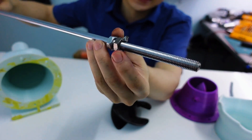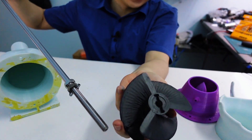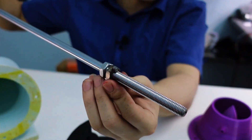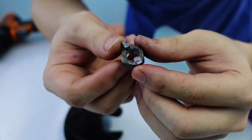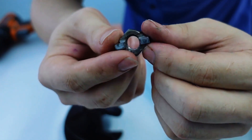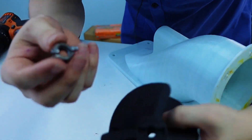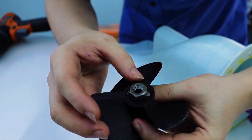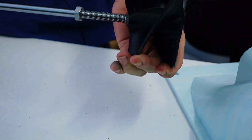This welded part is threaded — specifically a 10 millimeter thread — designed to connect directly to the shaft. There's also a small shoulder or flange built in to hold the fan blade securely in place, which is really important when the engine is spinning at high speed. Right here is the nut I've modified — I've welded two little tabs onto it. These act like locks to keep the fan blade tightly secured during high speed operation, preventing the blade from spinning loose or stripping the threads. Safety and stability first.